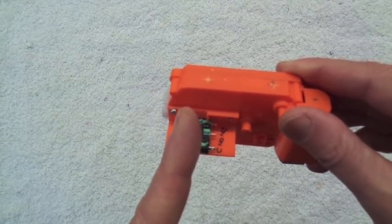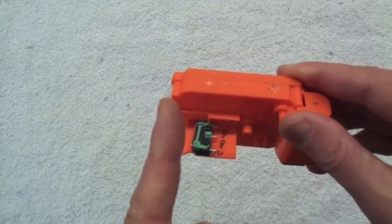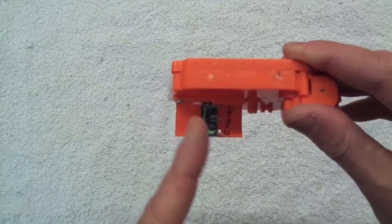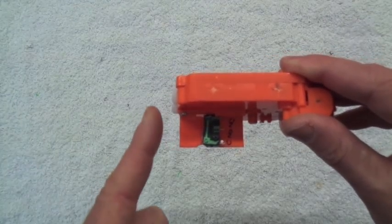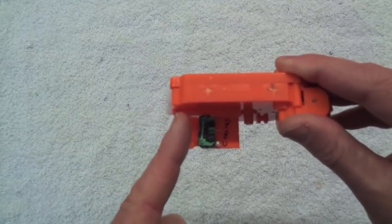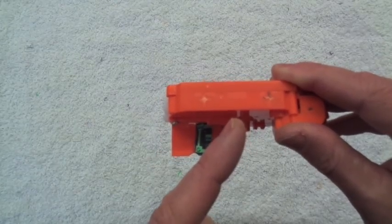As the pusher arm comes out, the lever comes out — the pusher arm goes forwards and at some point it's just going to disengage. The switch turns off when that arm is completely vertical, then the pusher arm goes forwards, comes back again, and engages the switch when that lever is fully vertical, pushing hard up against the body again.